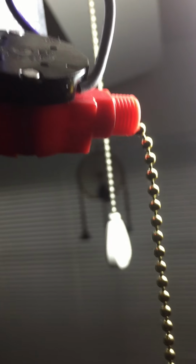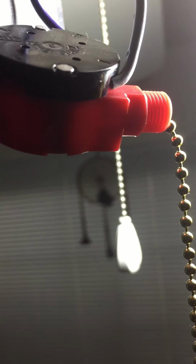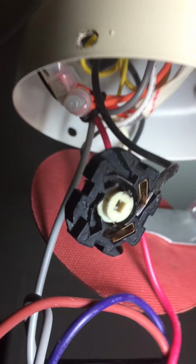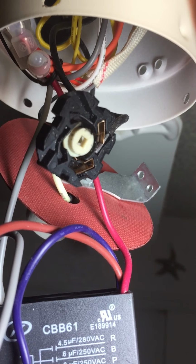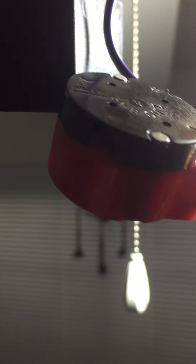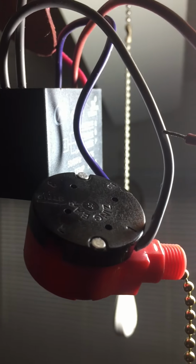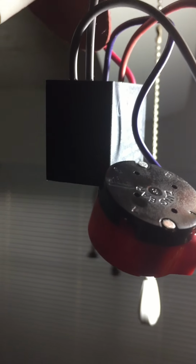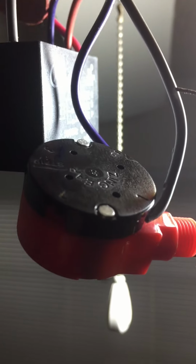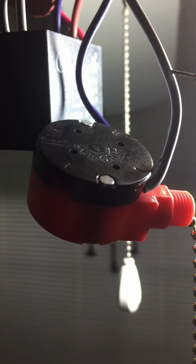Like I said, I've already transferred two, and it's not as hard as it seemed initially, but only because we went ahead and understood how the wire tips were inserted in there. That's my last wire, the L wire. That's what that old plate is hanging from, my L wire. It'll be simple. I already got number 1 wire in there, number 3, and now number 2. Make sure you correspond the coded wire to the actual terminal it needs to go to. And yeah, I know I'm shaking all over the place.